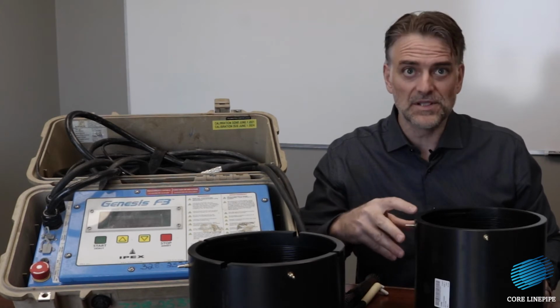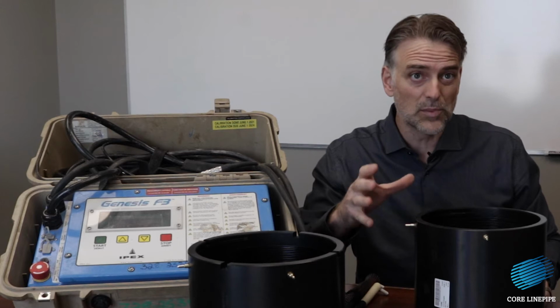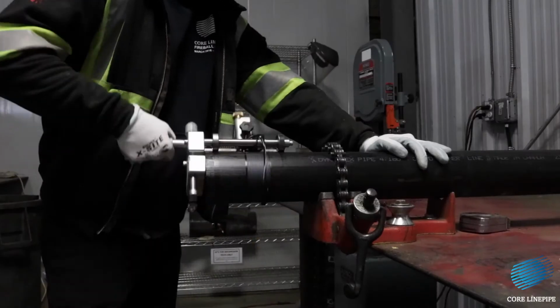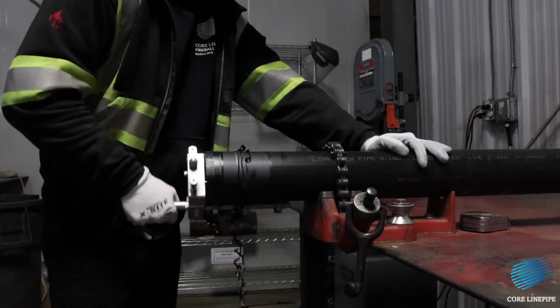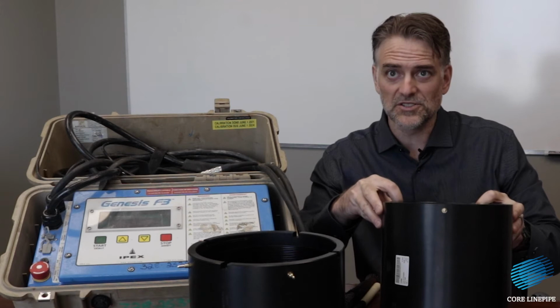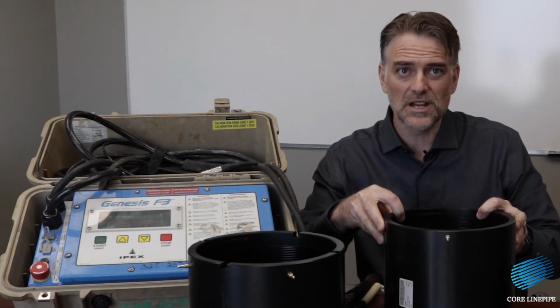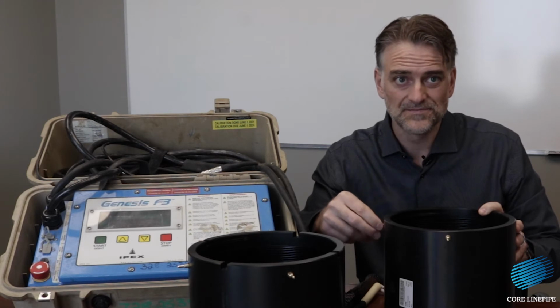As mentioned, the couplers are used to connect 2 pieces of liner. When the parts are put together, it is very important that the liner is scraped to remove a layer of oxide that is produced during extrusion or manufacturing. The couplers do not need to be scraped as they've been machined after extrusion. Scraping dimensions are temperature specific and covered by specifications and work instructions elsewhere.